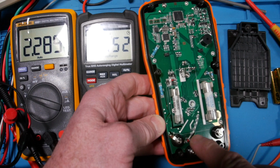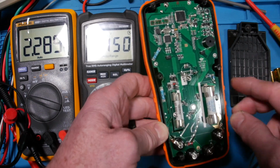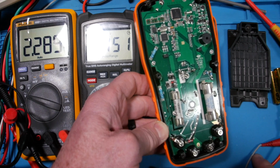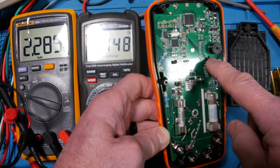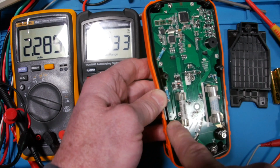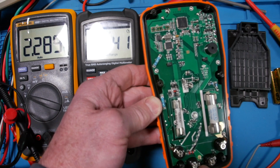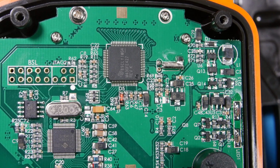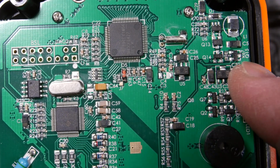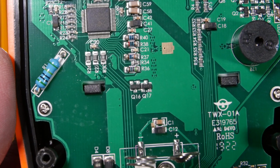And see the resistors in the chain here? Large through-hole resistor. Look at these large diodes. Those are some pretty good-sized MELF diodes in there, and our MELF resistors over here. And then see the little plastic tabs that capture the board? You can see the cutouts in the board. Looks like a very clean board, and the terminals are bolted down. Looking down inside there, they look solid. Okay guys, for those of you that like to look at the chips, it looks like a bunch of regulators in here. A tantalum capacitor there, so no aluminum electrolytics to wear out.